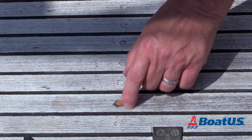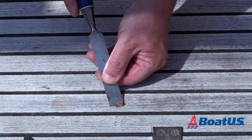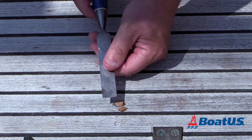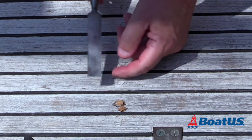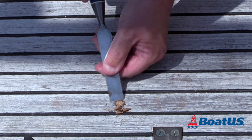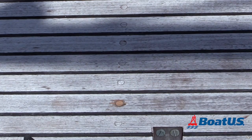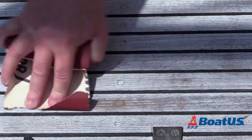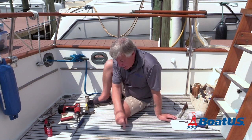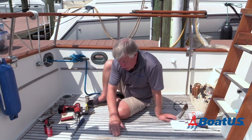I've still got a little bit of bung showing there. I could just sand that down but it's going to take a long time, particularly if I had a lot to do, so I'm going to use my nice sharp chisel and just shave that down until it's flush. You'll notice that I'm using the chisel upside down — this is an important tip, because if you try to do it the other way it will just dig in and you'll either pull the bung out or make a big divot in the deck. Do it carefully with a nice shearing action, and it's important to make sure your chisel is sharp. Then just get a bit of sandpaper and sand that down. One question people often ask is why it's a different colour — that's because we've just taken the grey off, but this is going to weather in over a couple of days or a few weeks and it'll be that nice silver-grey colour.